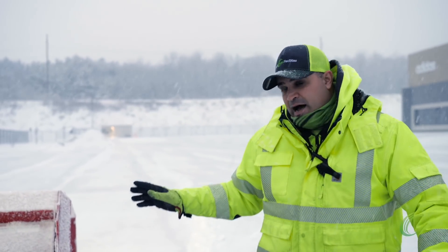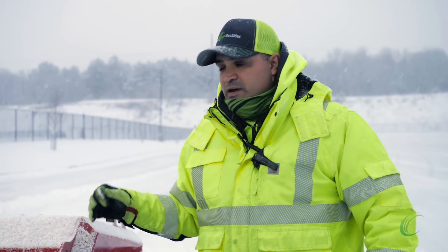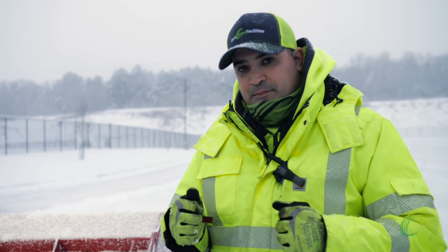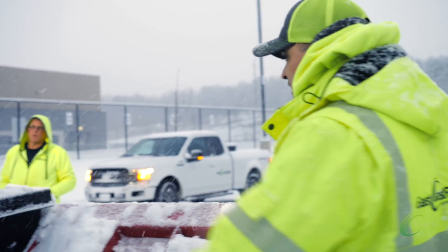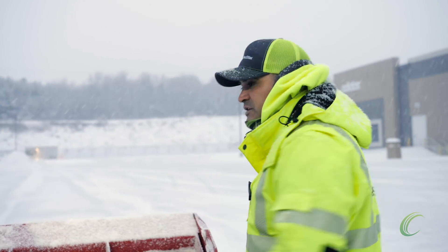What's nice is that it's a box and you've got the sides so that it can carry snow. To recap: we looked at the proper way to set up the chain and binder, and we looked at the proper height to make sure that our bucket is in a float position so that this pusher can move up and down based on the pitch of the terrain.